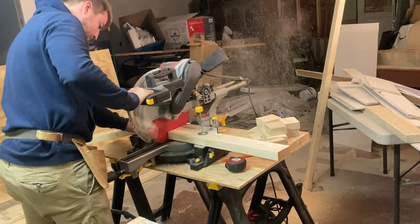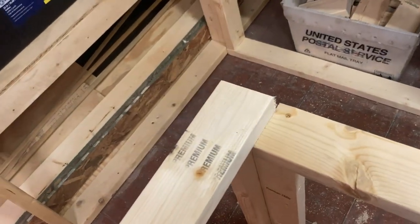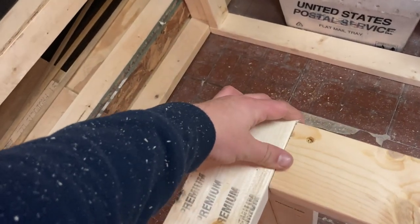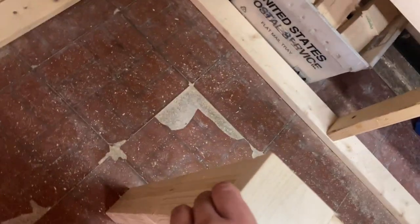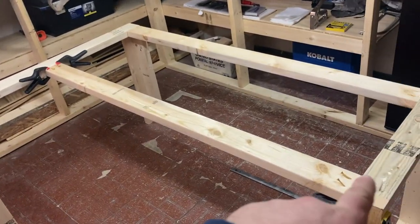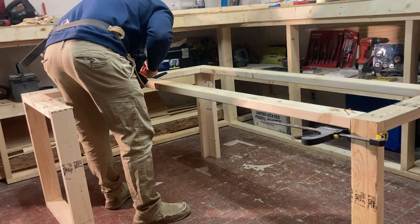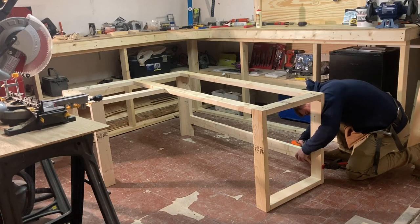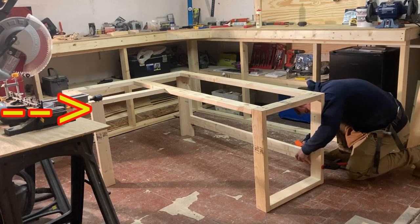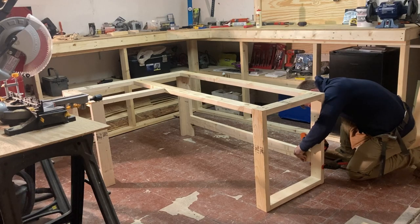Now let's cut the side that's four foot long — we're going to use the same thing, just pocket holes and glue. On the back side it's going to sit nice and flush on top of the L-shape we have in the back corner. We're going to get another five-foot piece — pocket holes, screws, and glue — using clamps to hold it up. Then we go down to the bottom, take that third five-foot piece, and make legs. Right where that arrow is pointing you can see we also put a piece over there for more support.